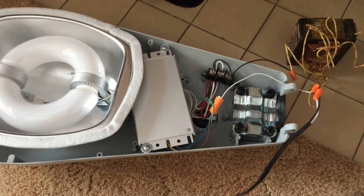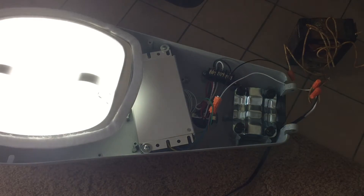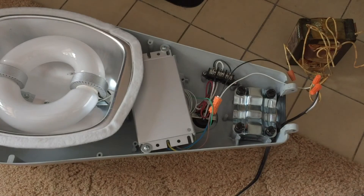Let's go ahead and take our plug here and plug it in. And there you go — we're now running a 277 volt fixture from 120 volts. Fantastic. This induction fixture is 80 watts, so it's quite bright. Again, this is only for experimental purposes so it shouldn't be left on too long, except for this little demonstration here. So we'll go ahead and unplug it, but that is how it works.